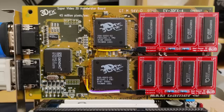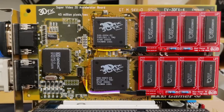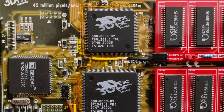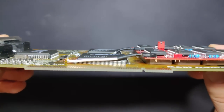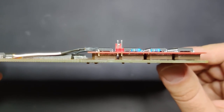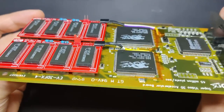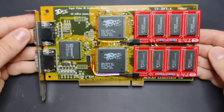Although this is supposed to be a permanent solution, I still added connectors to the end of the thicker wires that eventually connect to the 3DFX chips. I may want to borrow those memory boards for other cards in the future, provided their memory layout is similar and compatible. And finally, we are done. The card is finally upgraded to 8MB. I am absolutely happy with the outcome. The memory boards fit perfectly over the existing memory chips — no gaps and no issues with slightly misaligned sockets. Great, let's see if the card works.